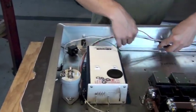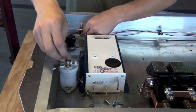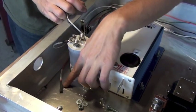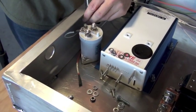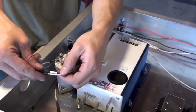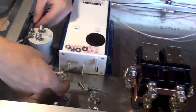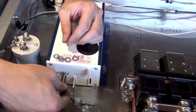It's good practice to keep the wiring as neat and organized as possible as you go through each step. The orange wire ends up near the opening in the box for later attachment to the cable harness — that connection will be completed after the high voltage control enclosure is installed into the vehicle. The other two remaining wires are the black and white wires for controller positions 2 and 3. The black wire goes on position number 2 and the white wire onto position number 3, sliding onto the spade terminals on the front of the controller.